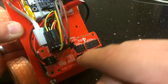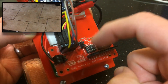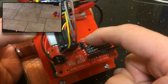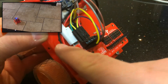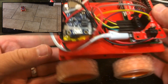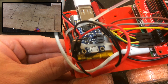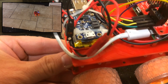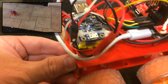I've got the board powered from the Pi. The motors can also be powered from the five-volt connection, depending on where the jumper is — either fed from the Pi or from the five-volt USB. I've opted to power the motors separately, so these wires are directly connected to the power boost which has a direct connection to the battery, meaning the motors run at 3.7 volts. It's quite nippy — it'll be nice to run at 5 volts but it runs very well at 3.7.